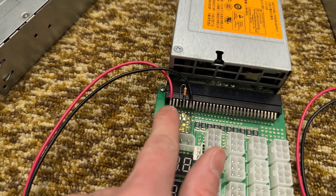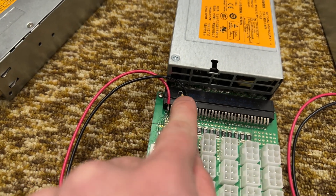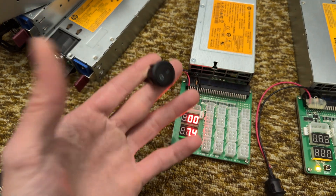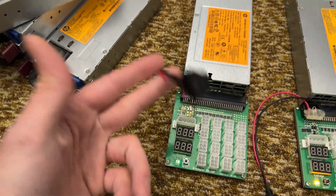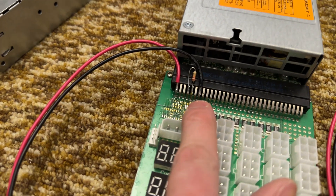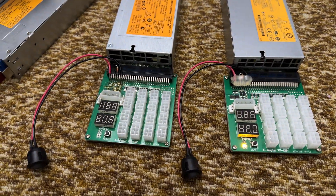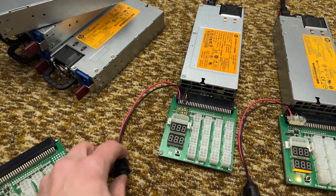You can see this wire on pin one, and counting left to right, seven being the black wire — we put a jumper wire between pins one and seven. I actually have a switch here, and what this allows me to do is turn it on and off externally. You don't need a switch, but I'll link it in the description, along with the resistors. Any of the cheap ones will work. I like these because they have wires pre-soldered, making this really easy. They're pretty cheap and available in multi-packs. You can tack them on there, and I'd recommend a blob of hot glue to protect it so it's a little sturdier and doesn't rip off. Or you could just jumper one to seven with a piece of wire, and when there's power it'll always turn on.